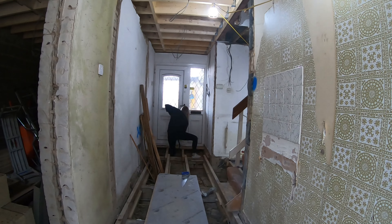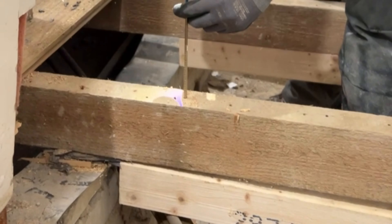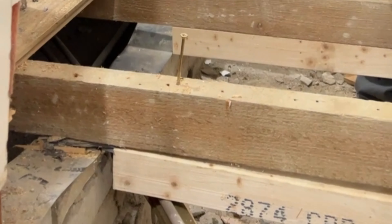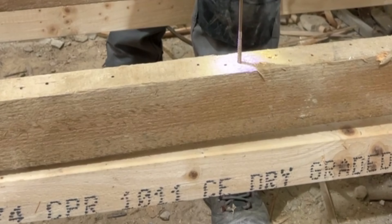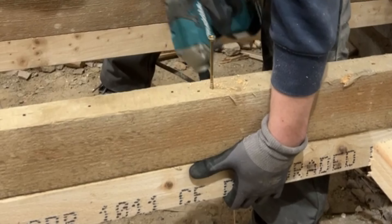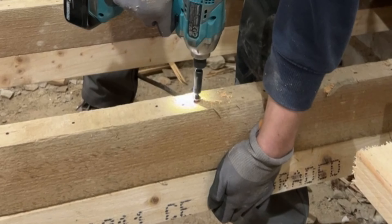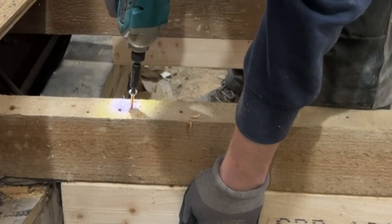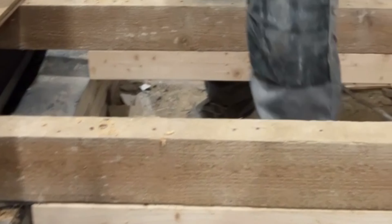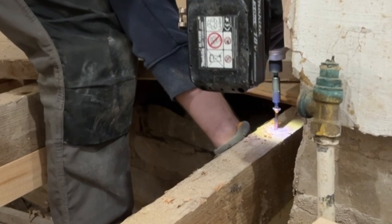The builders did recommend that we replace the joists, but there was a lot more money to be spent there and these joists are good - they're just not deep enough to hold the insulation. So we extended them. They're about 100mm as they stand now. We put an extra two-by-three underneath each of them so we could batten on the side, slot the 100mm insulation into the gaps, and get the 25mm depth we needed for the pipe and the screed above. There was a lot of old pipework from the original heating system to take out, but it came together and turned out quite a nice job.